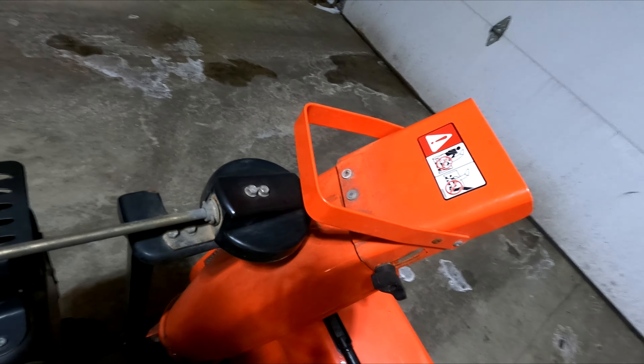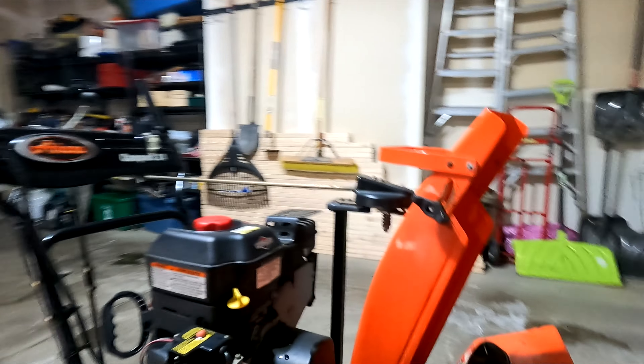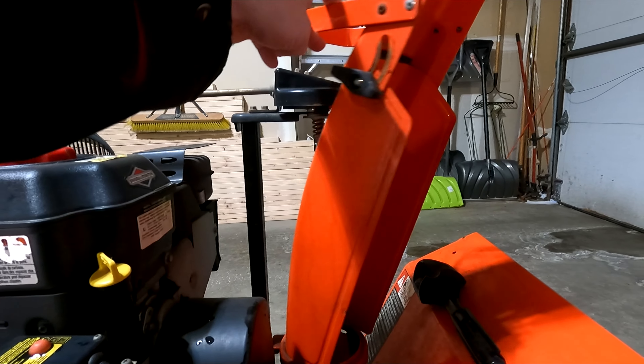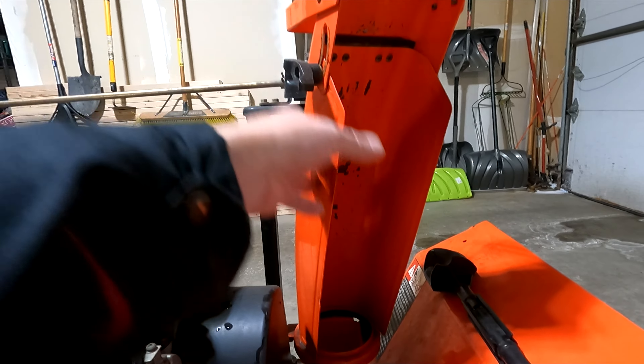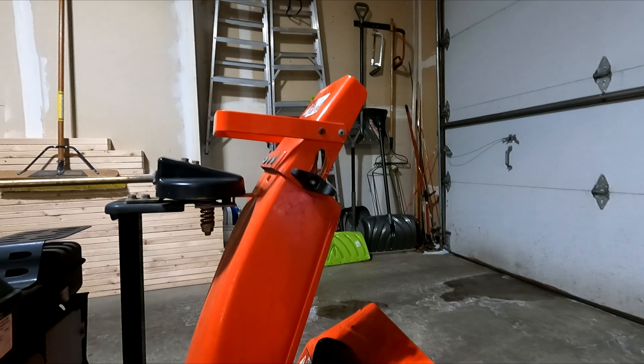You shouldn't really be able to move it with your hand. Back here is where you also use the control to move it back and forth, but it's just so loose that I can move it back and forth with my hand. One of my viewers pointed this out when they were watching my videos — they could see that under power this chute was really moving around a lot. They mentioned to me that there's a spring adjustment underneath it that you can use to adjust it.